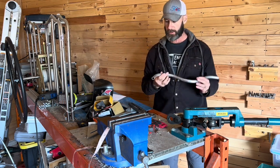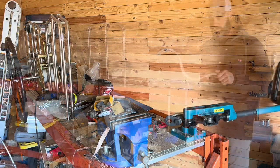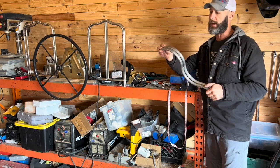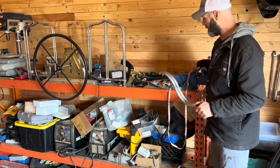That is what we're shooting for — we wanted that one as close to 90 degrees as we could get. We're going to repeat that process of bends for the next one, then compare the two. If there are any other bends in tubing that you need, just follow the same process: put it in your bender, look at the angle, bend it to that angle. The setup would be the same if you have the bender that I have.